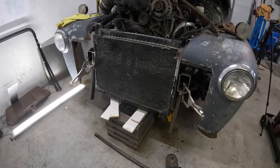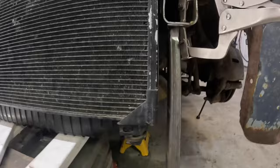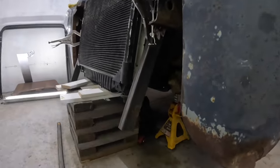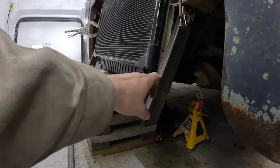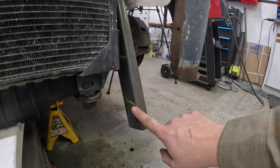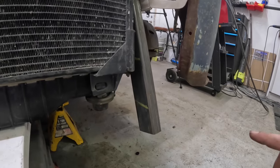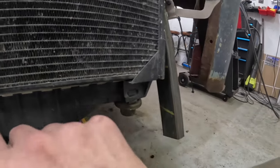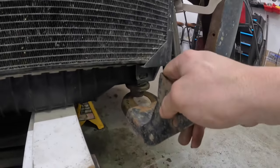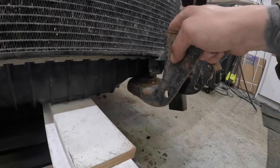I've had some ideas kicking around my head. This is where I'm going with it so far — I had the grille on when I made these, just got them tacked together for now. Going to come down on an angle like this. The grille I have marked out ends about there, the fenders end about there. So after the grille it'll come out and eventually tie into the bumper, and then go kind of across. I kept the factory Envoy rad mounts. With that bar across, I could just go like that — obviously chop them up a little bit and tie into that bar across.